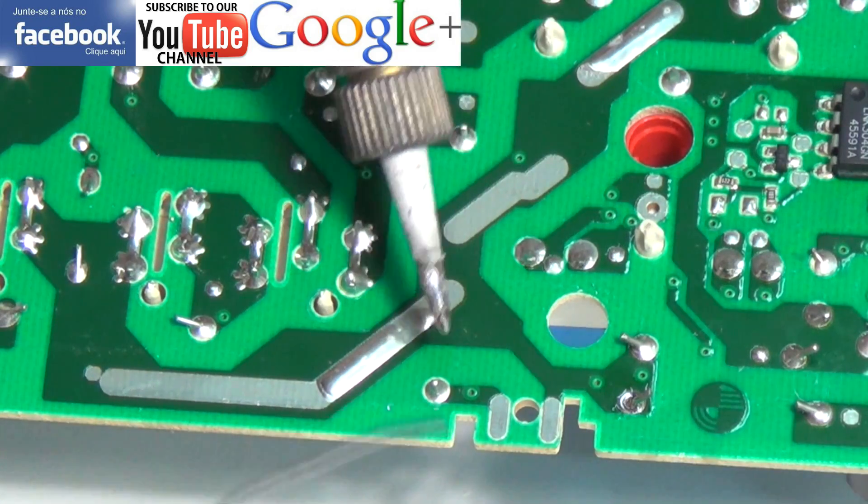What I'm going to do now is go into test sequence holding the two buttons down. Now I'm going to turn it to position 10 where I will hold the two buttons down again to clear the error fault. As you can see it was flashing E54 this time, but it was flashing E51 before. Now we've cleared it down — and there you go, it's clear.